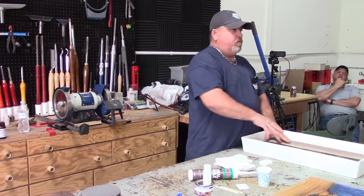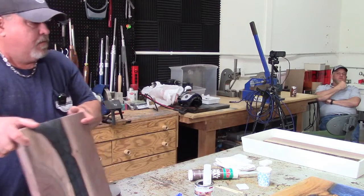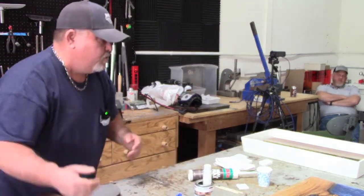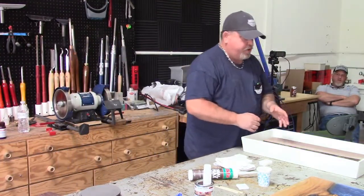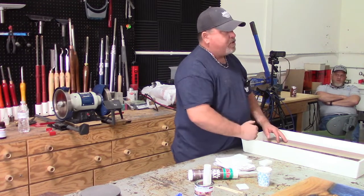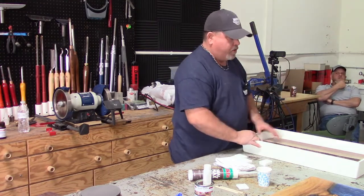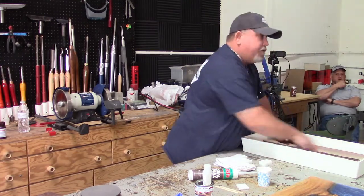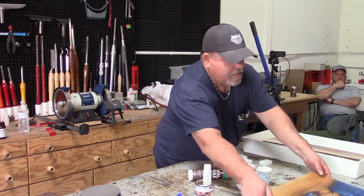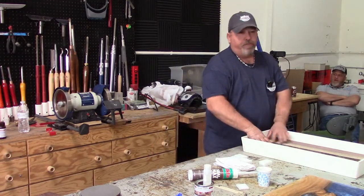There are multiple different ways of pouring your charcuterie boards. You could do a full pour where epoxy goes all the way to the top, or you can do a color and clear. It's whatever look you're going for. The key is to use the right epoxy for your job. We do a shallow pour and a deep pour. Shallow pour is up to three-quarters of an inch — anything over that and the resin will overheat and you'll have to throw it away. For the shallow pour, we do half color, wait 24 hours, then do clear the next day to get that color-clear look. Once you're done pouring clear, let it sit for about three to four days to demold.